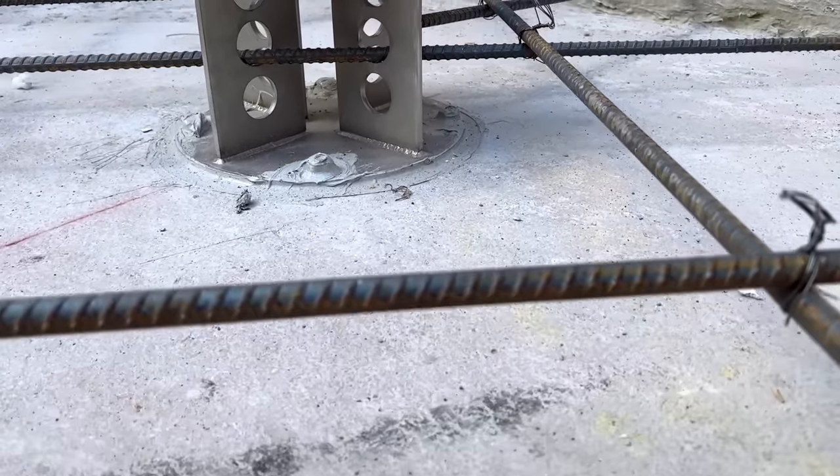It's a good morning — stayed up most of the night, got a couple hours sleep, and started pouring concrete. We've got the rebar down, all the pass-throughs through our steel cable guides and center cable guide, and the pipe all braced up off the floor so concrete can run underneath it — glued down to the floor off the spacer block so it can't lift up. We've got it covered in rebar. Let's make some mud — anywhere between a foot and eight and a half inches depending on where it is and how it slopes. Eight and a half inches is the average of this entire floor pour. Back to work.